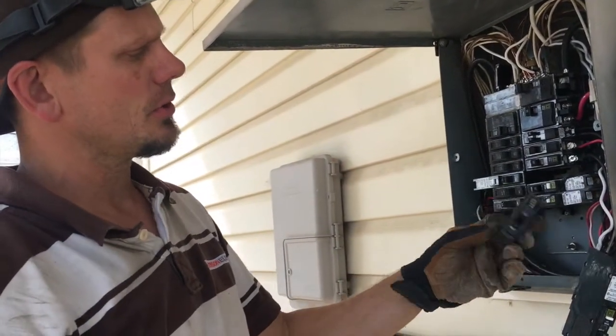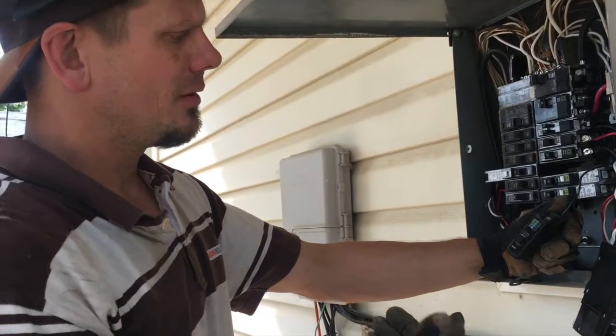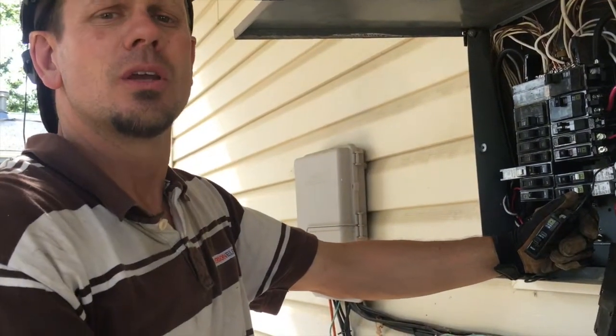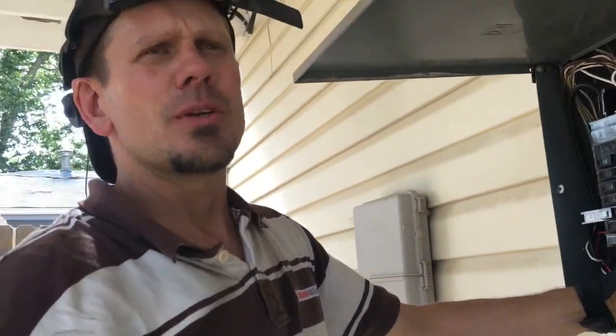Mind you, there's no ground because it was just a two-wire cord, but between the neutral and the hot I couldn't get this breaker to trip. The Square D QO is a great panel — it's an older panel, but this original breaker was not tripping. This guy would not reset, so I knew it was a neutral issue, because I had no ground going out that way.